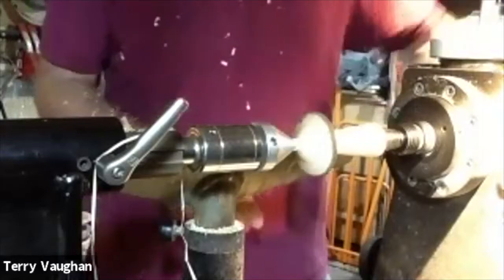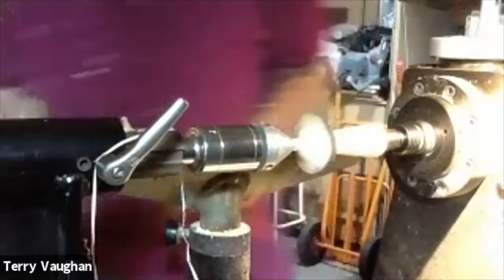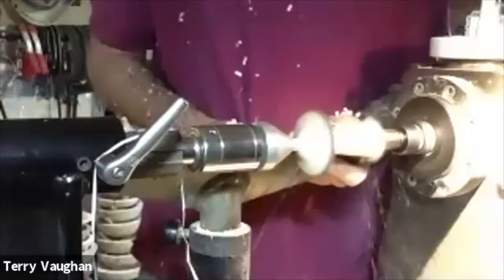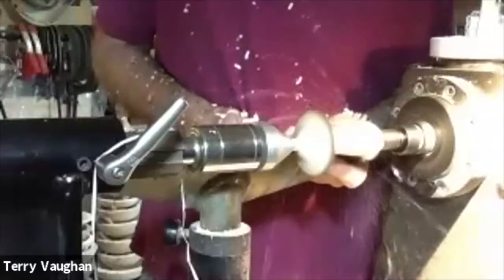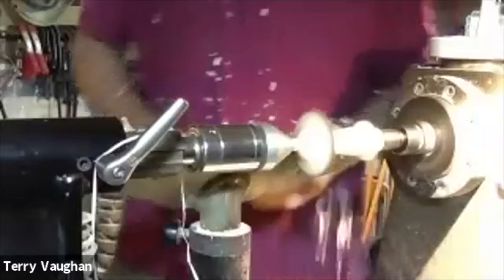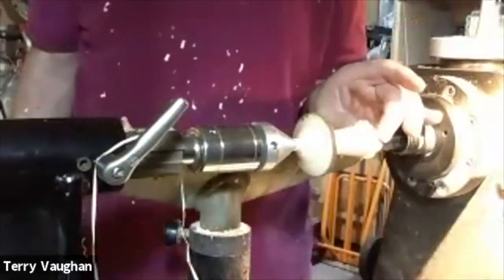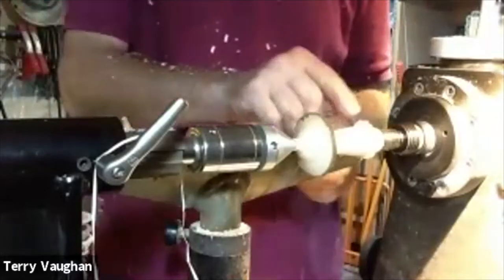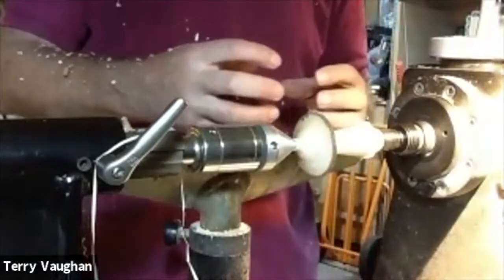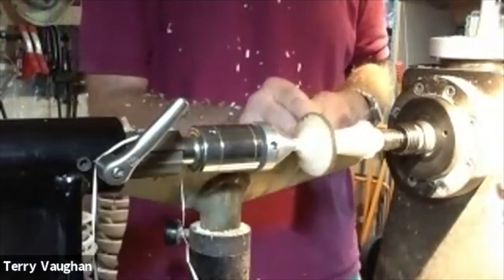What I'm going to do now is make this spigot. I've made the spigot a little smaller than the stem — that's to give you a surface for the stem to rest against in the chuck jaws. It's not critical, but now I can finish the stem there.